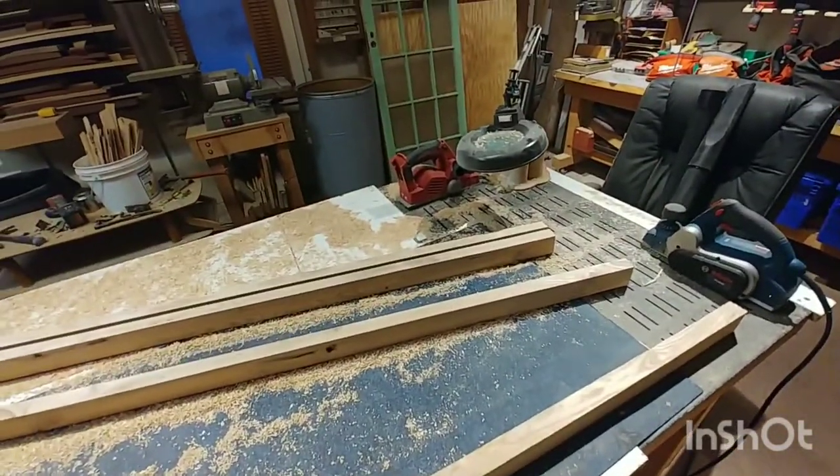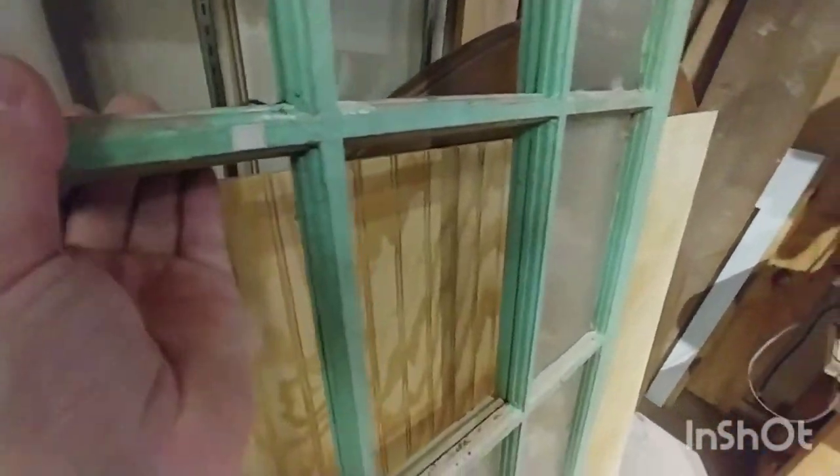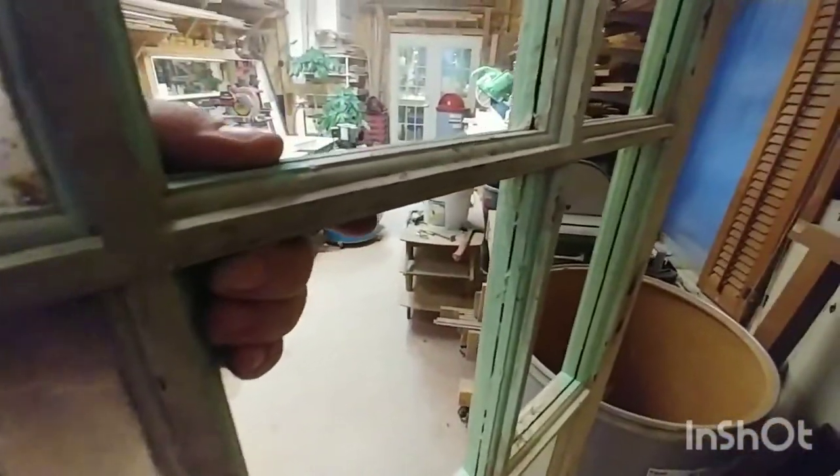And then I think the question is, because when you have glass lights in the door, glass panes, this is the millwork side. It has a profile. And the other side should be removable pieces of window stop. Looks like, is it this side or the other side? Anyway, they ought to come out of there so that you can repair the glass. We're going to have to put all four of these additional pieces, do our best to make them, pick a side, one or the other, to make the sides flush or just a little bit proud, and have everything else along the other side, because they're generally the same size, but we don't want them skewed when putting that whole assembly through something designed to make it all one thickness.